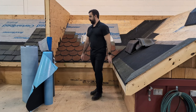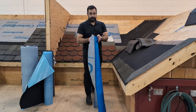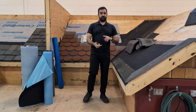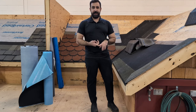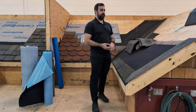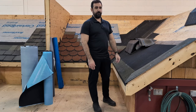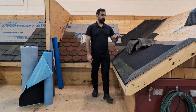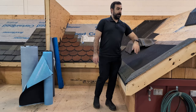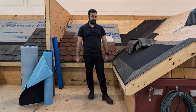Next, we would have our underlayments. We have our synthetic underlayments — like this, from CertainTeed — which replaces the use of 15-pound felt like we used to use. They create a few different versions: breathable, a high-end thicker synthetic underlayment, the Roof Runner being their entry level, Roof Runner Air being breathable, and then they have their Diamond Deck, which is a little step up from the Roof Runner. Your underlayment would go throughout, covering your entire roof. We'll get into more information about all these components in future episodes.